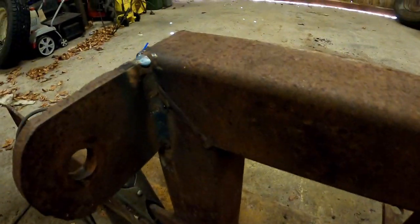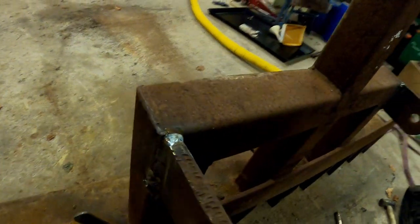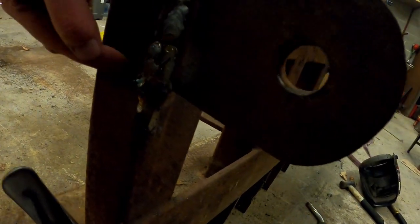That's it — they're all fully welded in. Quite happy with them; they turned out quite nice, welded all the way around. Got a little bit porous out here but I'm not too worried. I'm not going to gusset it because, to be honest, this has been perfectly fine for years, and those welds are probably a bit stronger than the ones that were holding on beforehand. It seems to have penetrated quite well. I'll turn it around, hook a tractor on and take it out.